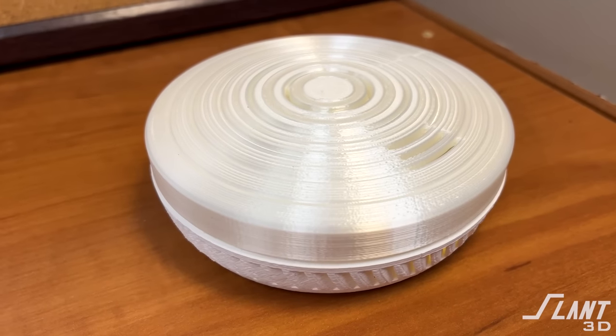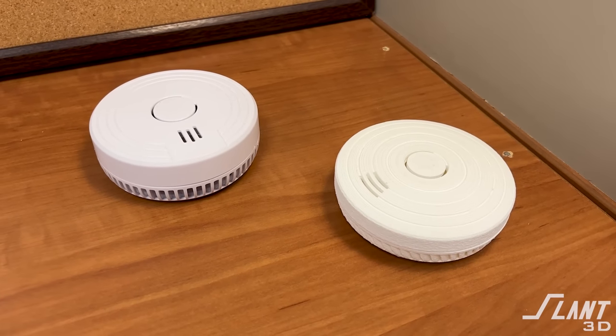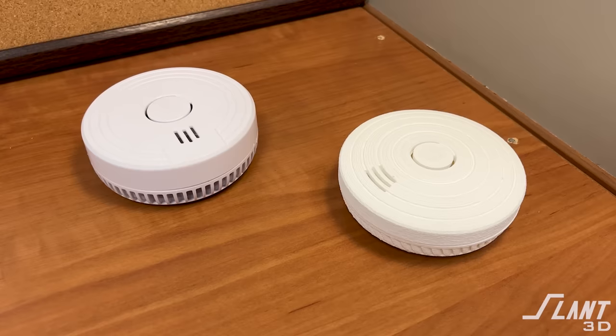If you really want to go further, you can use different colors entirely — for instance, a pearlescent white, which really helps improve the appearance over a native 3D printed white. It is a more expensive material, but creates a different aesthetic. So to summarize: round 3D printed enclosures for mass production are actually quite difficult to work with. If you just ask us to 3D print your injection molding design without adapting it, there will be problems with quality, appearance, strength, and structure. But if you design for the process, you can end up with something pretty much equivalent to the original — now made with 3D printing, with reduced or eliminated startup tooling costs, and the ability to experiment and change your design without large tooling change costs.